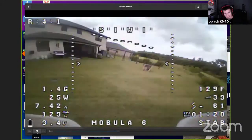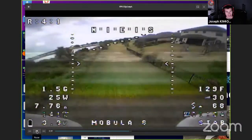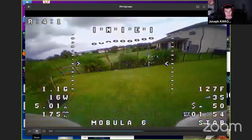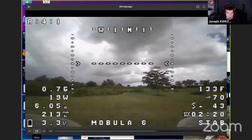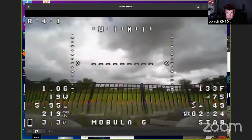Well, the funny thing is, you could stand out in the parking lot and fly this, if you have a good antenna system. It's a bit more difficult to do because these are the ones that have really weak transmitters in them. These will have like 25 milliwatt transmitters in them, just because you don't want to use up so much battery when you're flying these, and you usually don't want to fly too far either. So keeping that battery drain down is good, but you sacrifice performance.